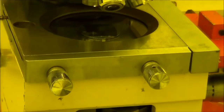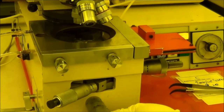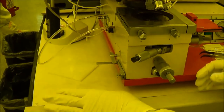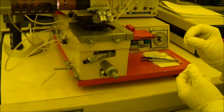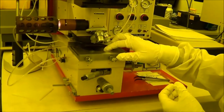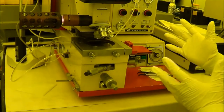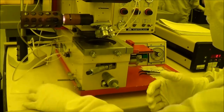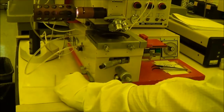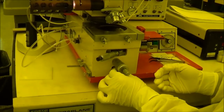Right, and so this is the first step. You place your mask and slide in the sample, and then you need to lower the stage a little bit, because you don't know what the previous user used. Some users use a very thin wafer and a very thin mask, and some users use a glass slide that is very thick, and probably the mask thickness is also different. To make sure the safety is enough for your mask and for your sample, you lower the stage first.